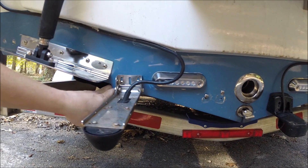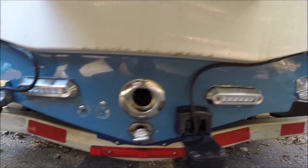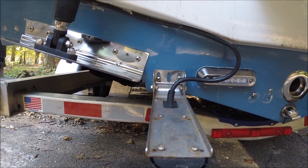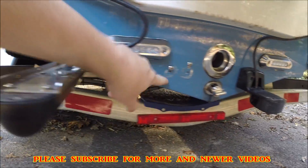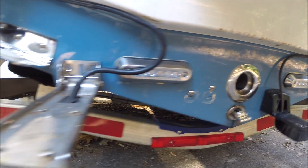Anywhere from the first lifting strake straight down is where I like to put them. Now a transducer this size can cause cavitation in your motor — believe it or not it'll push enough water down that your motor will get some air. So you can see I had it installed here very low, my motor was cavitating a little bit, so I moved it out.